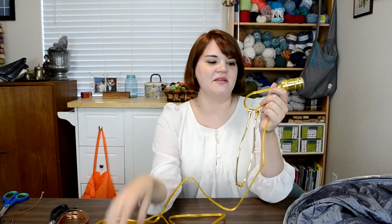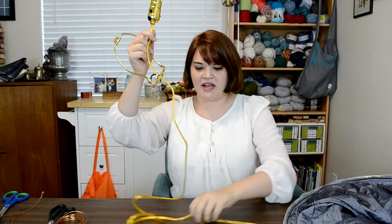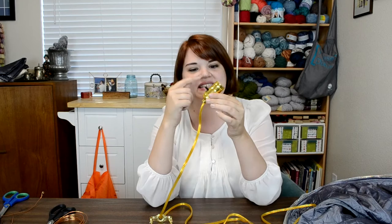This is your lamp hardware, and it is so easy to put together that I did it by accident — I was just checking to make sure that I knew what I was doing, and I already assembled it. Basically, you need this little lamp socket and you need the wire that you can plug in — both of these you can buy easily from a million different kits. And then you need a lamp harp. The trick is I installed my lamp harp before I installed the socket, so I ran the wire with my plug through the bottom of the lamp harp, then put it into the lamp socket and attached it to the little screws that are in here to keep the wires connected. You can follow all the instructions on the packaging — I did it by accident, it's so simple.